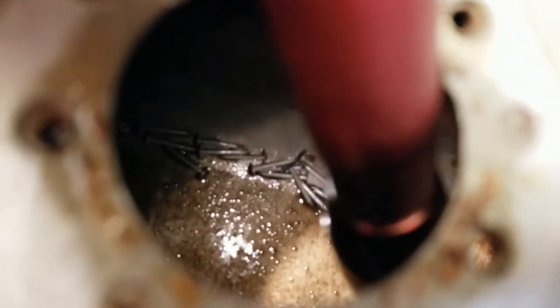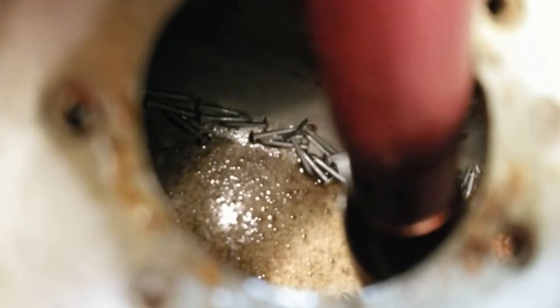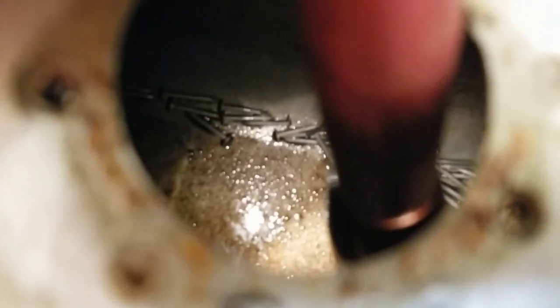I'm going to try to shoot the camera down there — that is the result of my rust remover. You're looking at clean metal down there. That's rust remover and some galvanized roofing nails, shake it around for a couple days, hit all the sides, and she comes out looking pretty good. Now comes the fun part — rinsing it and getting all those nails out. This is the third or fourth tank I've done like this; they come out pretty good.